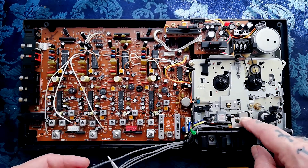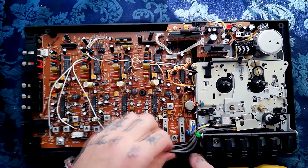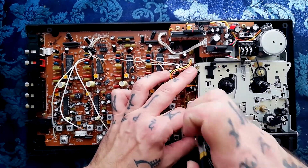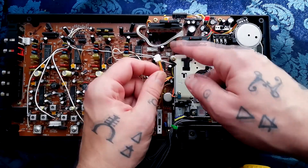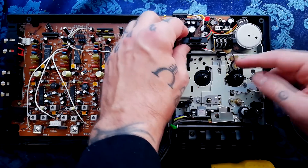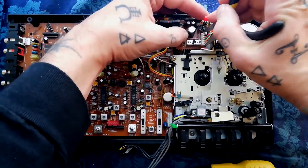The leads go to your record and playback head — tracks one and two — it's all labeled on the PCB. There's a little cable tie screwed into the PCB below. The black cables have a single socket for the erase head. The only other cables connecting are the double wire one in the top right corner of this record/playback PCB, and then there's the cable going to the motor, which is underneath the zero return switch cap — lift that cap off and keep it safely to one side, then you should be able to get this cable out.